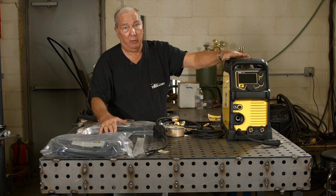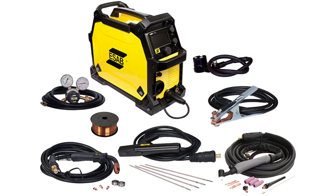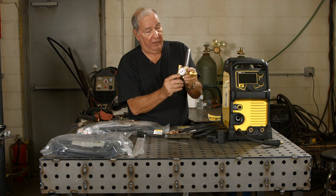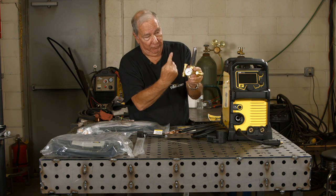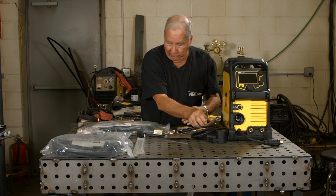This is the multiprocess model, so it comes with everything you're going to need. It's a multi-voltage machine, so you have a little pigtail adapter that comes with it. You get your gas hose, a sample pack of .030 ESAB MIG wire, your ground clamp and cable, your regulator so you can adjust your gas flow. This is actually the kind of regulator I like that has a little ball that floats in here, because they're a lot more accurate than the ones with a separate meter.